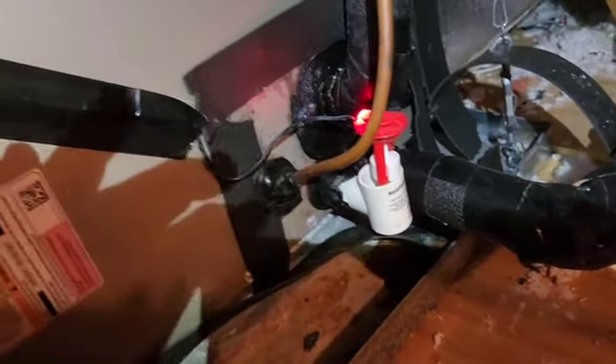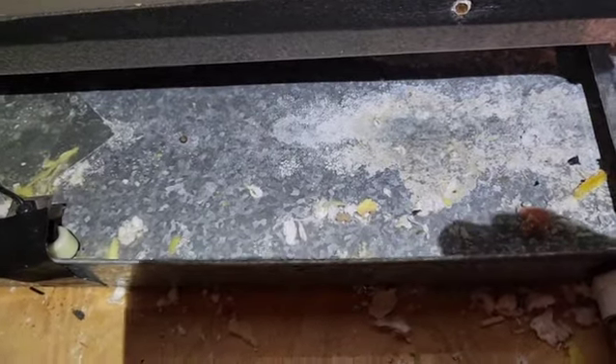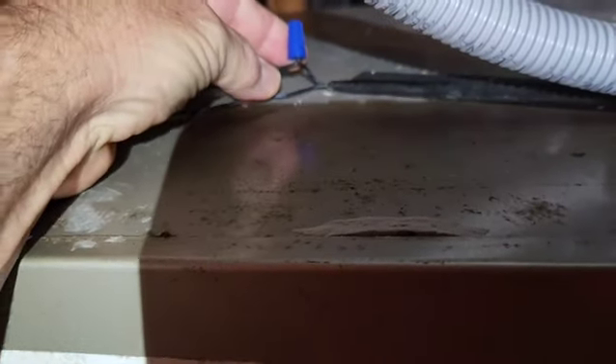Something to note: in my case, there's an overflow pan underneath the air conditioner unit in case the switch doesn't work or if it floods too quickly — which is great because we don't want it leaking through the ceiling since I'm up in the attic. There's actually another float switch there in case that pan gets full. So they've done a three-way switch here: they've taken the two wires from this float switch and the two wires from the other float switch, joined them together into one circuit. So if either one gets tripped, it cuts off the air conditioner.